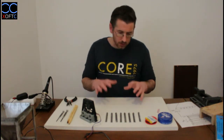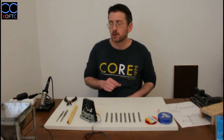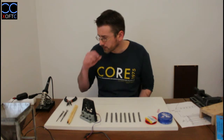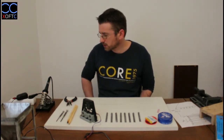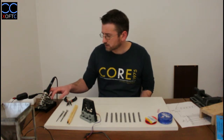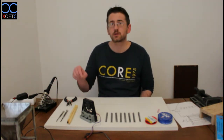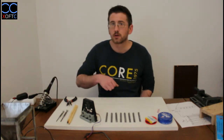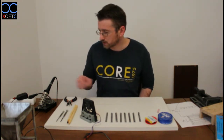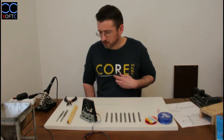Don't leave it on if you're not going to use it for a long while. So the goal is you want to have all your parts prepared, ready, you measure them, you align them all together, you know exactly where they're going to go, so that it doesn't just stay on while you're trying to fix different things. It's going to burn out the tip, and it's just going to shorten the life of the soldering iron. I use this sponge. I mentioned this sponge in the first tutorial. It's a metallic wire, used to scrub dishes, and it's very good for cleaning the tip of the iron every time that we're using it. After every pass we're going to clean the tip. It's very important, otherwise it's going to burn out. And that's it. I think that we can begin.